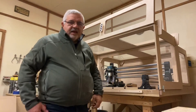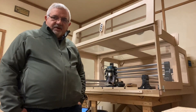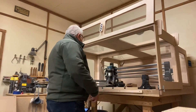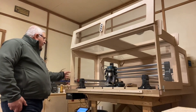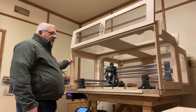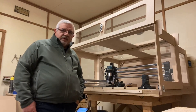One of the questions that came up after the first video was: can I build this on a 48-inch by 48-inch table? The short answer is no. The machine itself is approximately 46–47 inches wide, and when you add in the rails, the slides, and the panels themselves it adds about two and three-quarter inches on either side. So the actual width of the front section of the enclosure is fifty-four and a half inches — I would say a bare minimum 55-inch tabletop is what you're going to need.